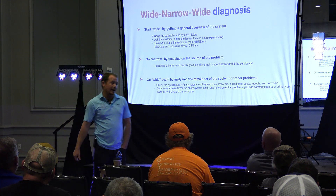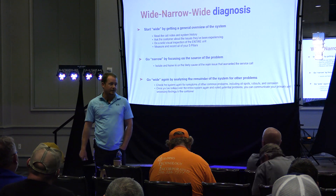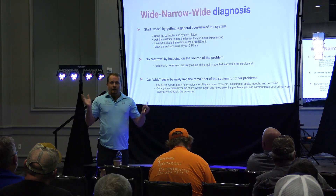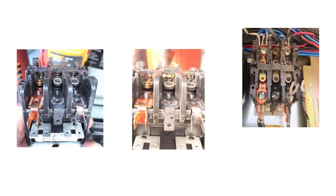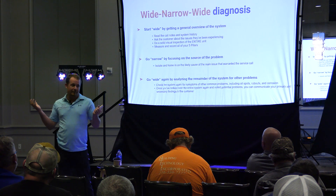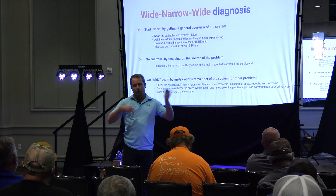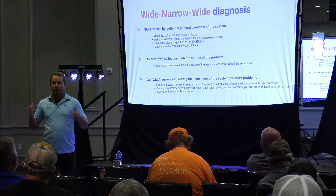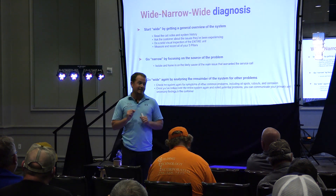This is a time-saving thing you can do right now. You're the troubleshooting tech, customer confirmed, you need a compressor, it's warranty — whatever. Go ahead and pull the charge out now. Make sure it's right where it should be — you've eliminated that. You've looked at airflow. We're going to go ahead and replace the start gear too. In commercial, that would mean always replacing the contactor as well, because single-phasing is such a problem. Make sure you're putting in the right capacitor that goes with the new compressor, because it isn't always the same.